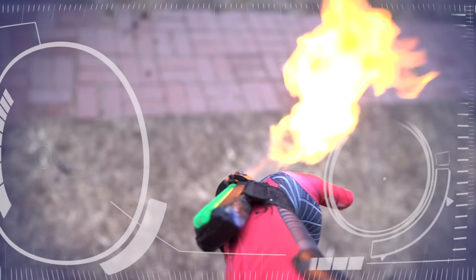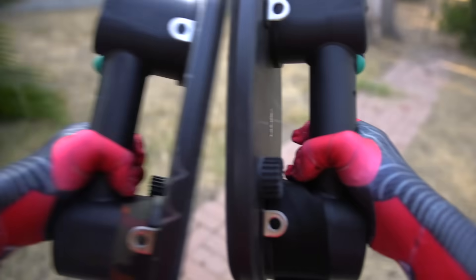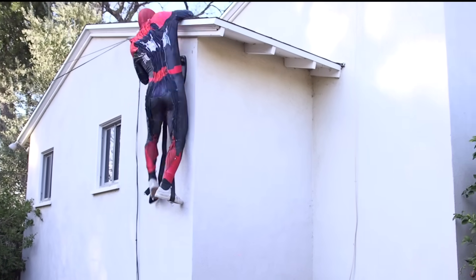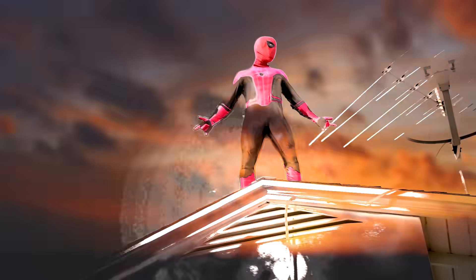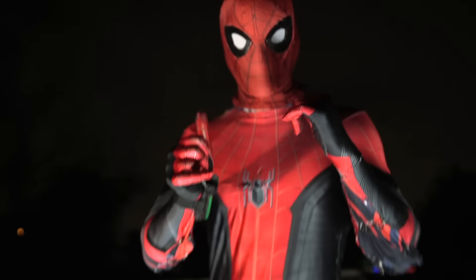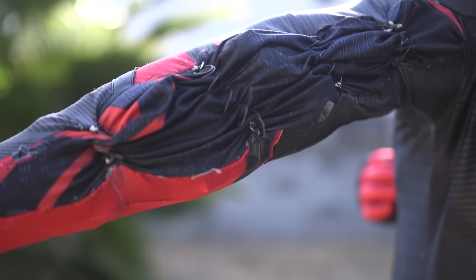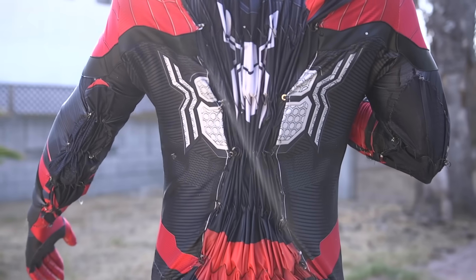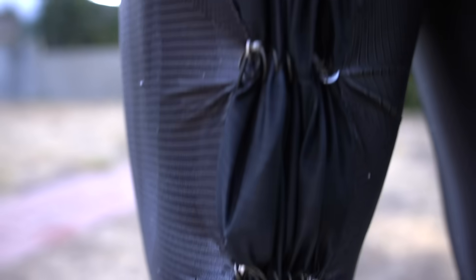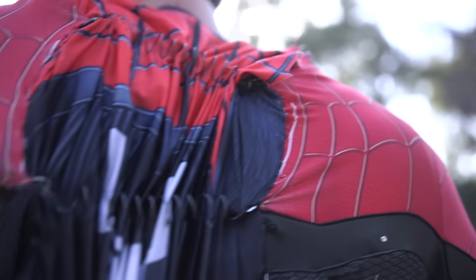Good evening Peter. Congratulations on completing the rigorous training protocol — you now have access to your suit's full capability. Basically I've got switches in my chest that trigger relays to heat up the springs, which causes them to contract. I can control each limb individually because areas like my back take longer to heat up than my arm, giving us a little more control. It's not perfect, but it definitely looks decent for a first version.